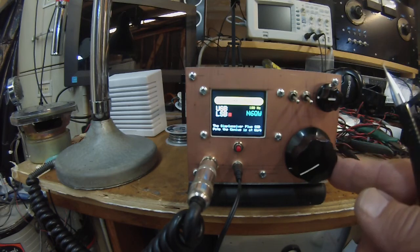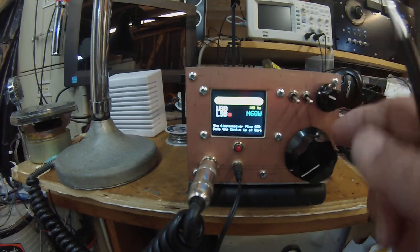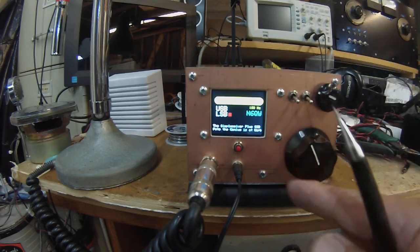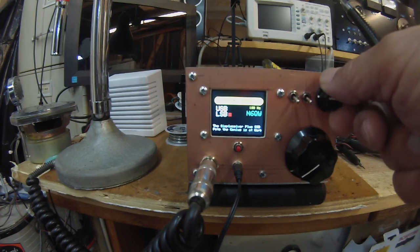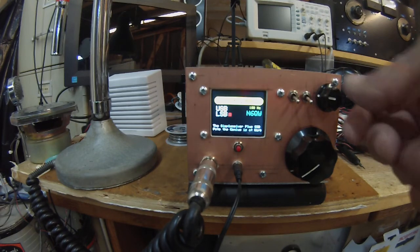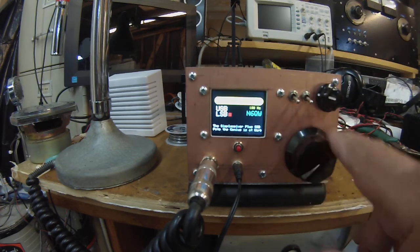The display is on there, and I made the LO range quite large, so if I wanted to put this on other bands I could do a minimum amount of programming. Or if I bypass the low-pass filter and band-pass filter, I could tune around — under certain band conditions you can hear WWV at 10 MHz; there's enough signal slipping through the low-pass, but it's pretty faint.